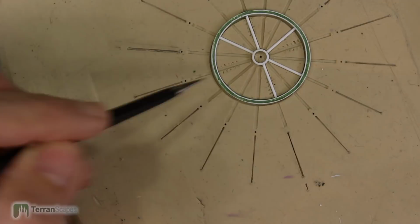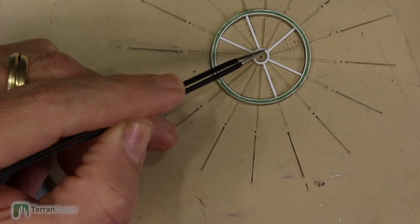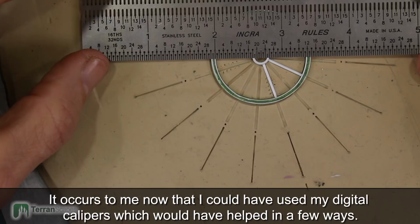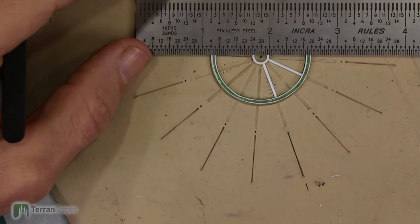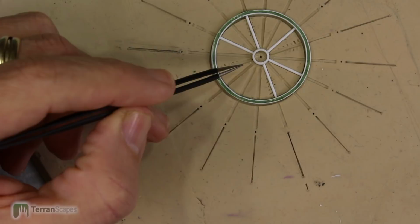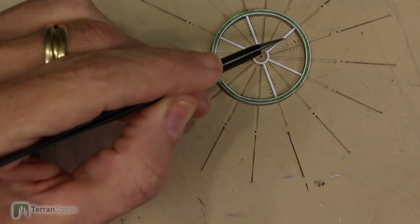When I did that math, I came up with 17 and a half thirty-seconds. All right, there's roughly our 17. It looks like 17 there. And from here, that's closer to 17 and a half right there. So I figured maybe I could just cut them to 17. It'd be fine. No, that's a big gap. Cut them to 18. No, they don't fit. 17 and a half was the number that was needed to get that kind of a tight fit,